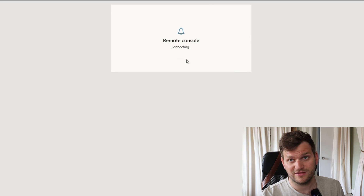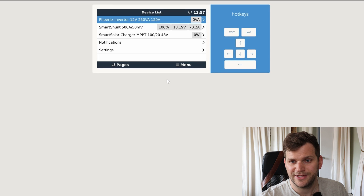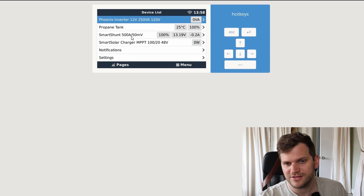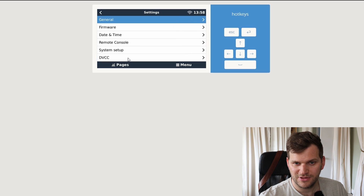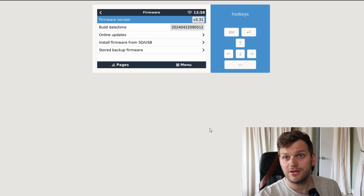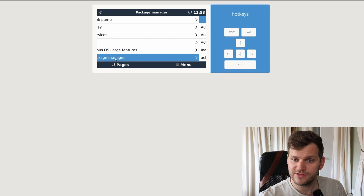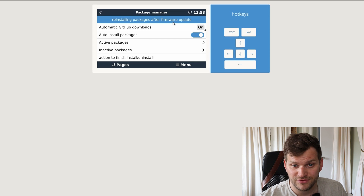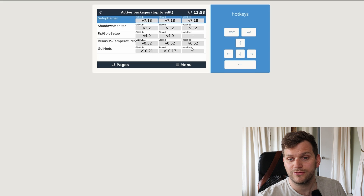It just did reboot. Let's reconnect and see what happens. We are back. It looks like no setup helper is installed at the moment. I just disconnected a battery — it shows 100% but only 13.19 volts. Going to settings, then firmware — and we can see it did install 3.31. Scrolling all the way down, we have the package manager — reinstalling packages after firmware update. That's exactly what I love about setup helper. There's a link in the description if you haven't installed it yet. We should wait a little longer and then there might be a reboot of the GUI, and everything we wanted online should come back.